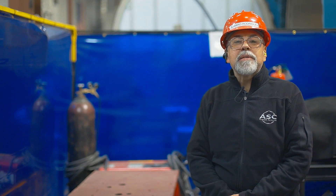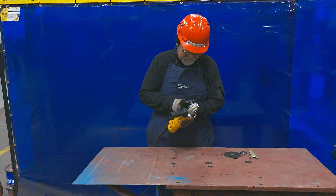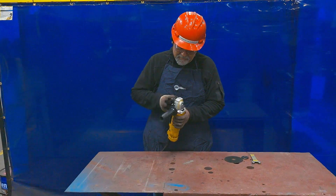After you put your PPE on, you can begin using the grinder, but you must inspect it before each use. Please make sure the grinder is not connected to an energy source before you begin inspecting. Start by ensuring the guard on the grinding wheel is not missing, as well as the handle.